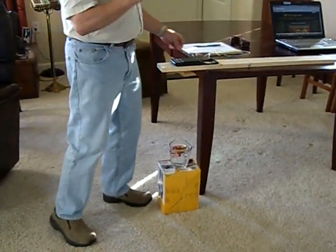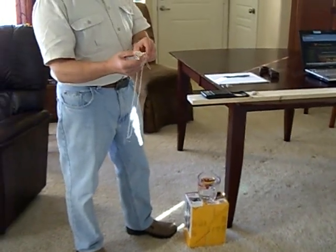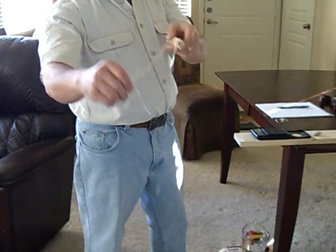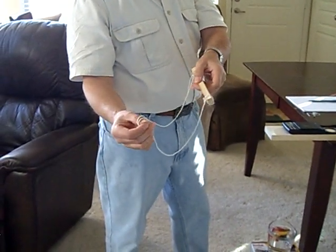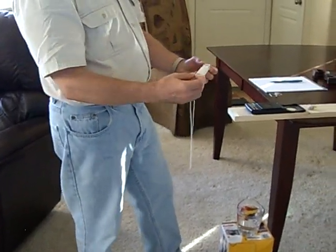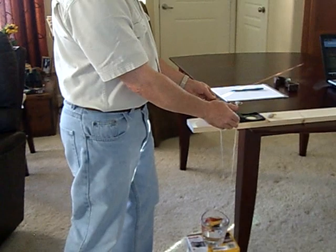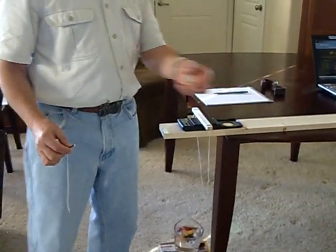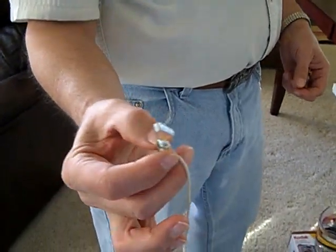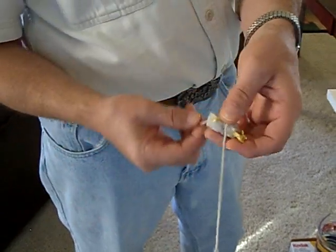You need to be able to suspend your gold and quartz in the water. To do that, you need another piece of wood — about three-quarters by a half inch. Tie a strip of string to one end of it, and on that string put a little round metal ring — I used a key ring. Tie the other end of the string to the other end of the wood. The piece of wood should be about four inches wider than your scale, overhanging about two inches on each side, and you're going to sit that on your scale. To attach the specimen, I used a small picture hanger — you could use a piece of bent wire — with a piece of string tied to it.